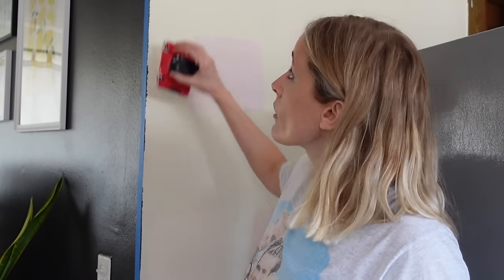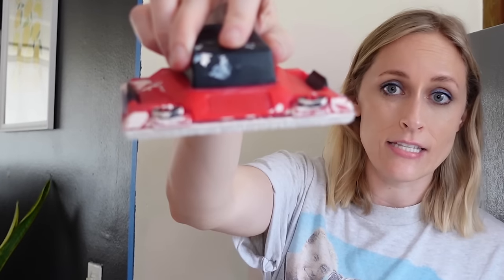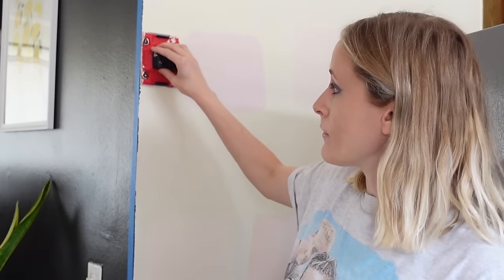Okay, so when you're ever gonna paint a room, you need to cut in first, which means you do the outer edges and the corners so that your paint roller isn't going up onto the ceiling and stuff. We did not really tape off the room, and that is because of this incredible tool. It is a corner cutter, and it's basically perfect, and it has these little wheels, and it perfectly helps cut the corners of your room. I'm just gonna take a little light dab. You guys see?